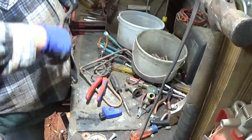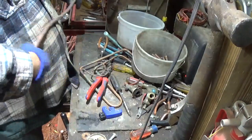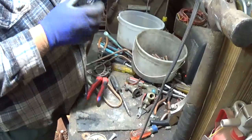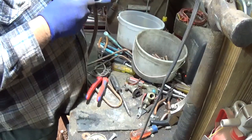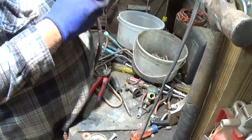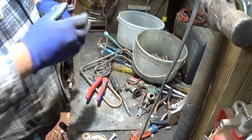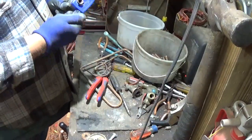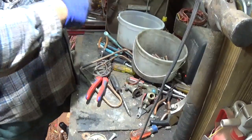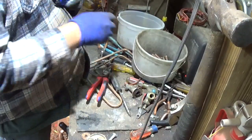Let's see if we can get this to slide down the shaft, down the tube — like this one. I find if I cut the tubing with an angle grinder or Sawzall or anything, then it leaves a burr on the outside and then your fitting doesn't want to slide off. Basically this is all number one tubing.